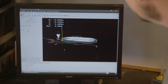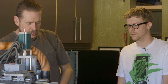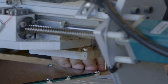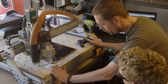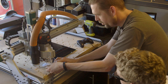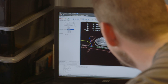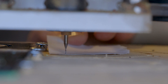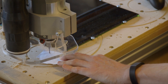You can see on the screen where the tool actually is by this icon. Now I need to touch off for the length of the tool — I'm going to touch it to the top of the board and call that zero, because everything I programmed is up from that. So anything below zero is cutting into the table, anything above is cutting into my part. I'll jog the tool down until I'm as close as I dare to be, then use a piece of paper as a feeler gauge. I can move in increments of five or ten thousandths of an inch. See, it's dragging — there we go. That's my Z zero.